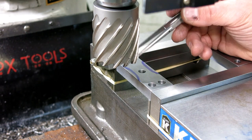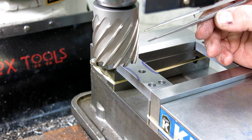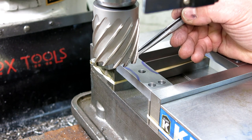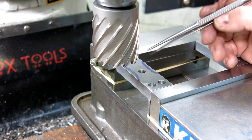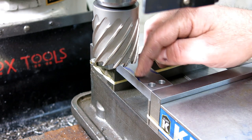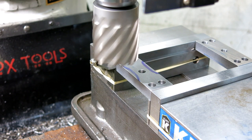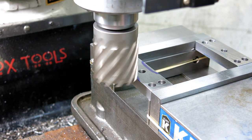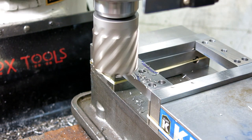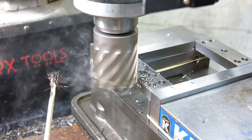We're going to cut these little scallops here, and I'm going to start with this annular cutter. You can do this with a boring head, and in fact we're going to finish them with a boring head. But I'm just going to take most of the material out with this annular cutter, and then I'll come in with a boring head and cut the correct radius — which is just slightly larger. This is 1 and 15/16ths, and it's a 2 inch diameter that we need. I'm sure I'm clamped well. These are nice because they don't care whether they cut a half a hole or a portion of a hole, and they make quick work out of it.